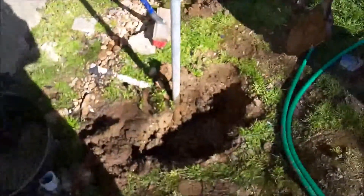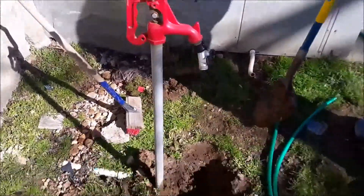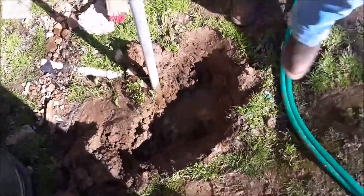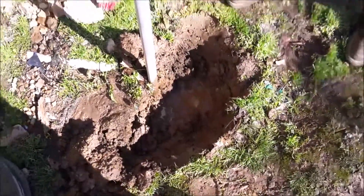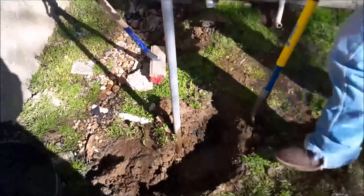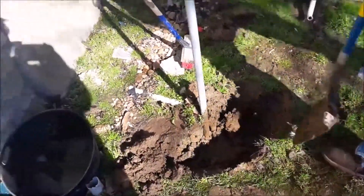What Greg's found right here is that this is where a leak is — right here at the hydrant next to the house, the frost free hydrant. It's already water filling up the hole. What we're going to do though is go ahead and replace everything anyway. We're going all new from the road to this hydrant to the house.